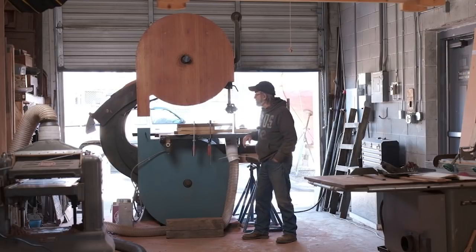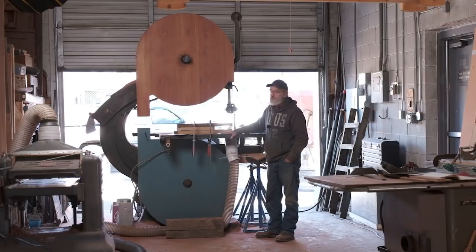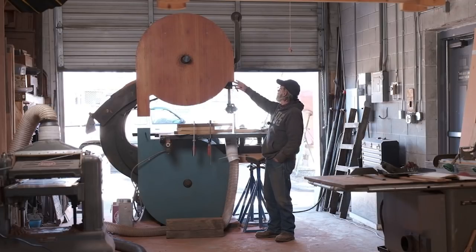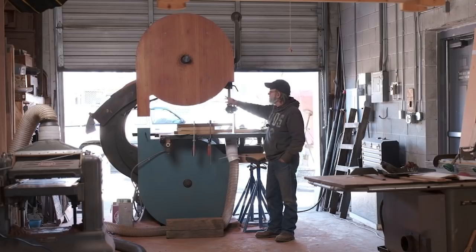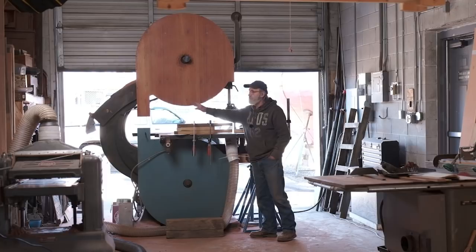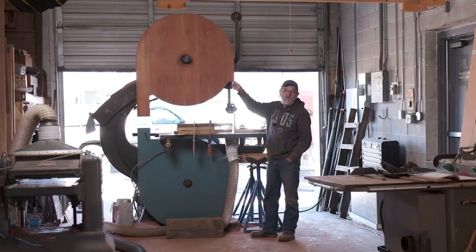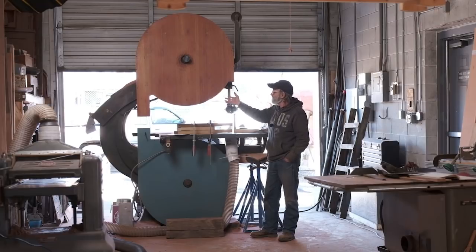We're going to do it on this bandsaw right here. This is a 40-inch L Power ship saw that I bought quite a number of years ago. It was kind of wrecked when I bought it — a building had fallen on it in 1938 and bent up some of the shafting on the tilting mechanism, and the wheels were all bad. They were made in sections, actually wooden wheels with metal spokes. I've replaced the wooden wheels with laminated oak wheels with very thin laminates and they come out really nice. The saw really performs well.